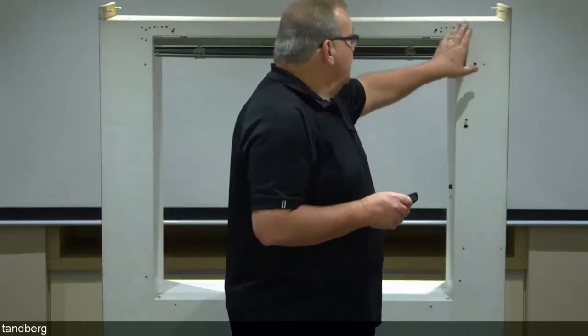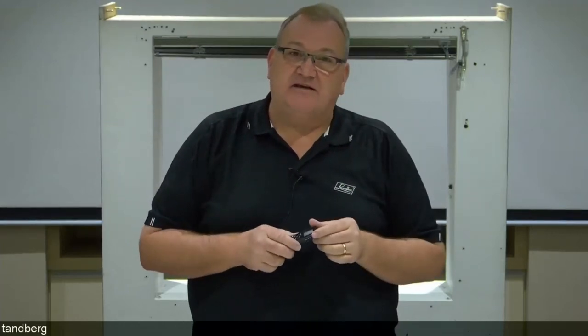I spoke about child safety when I had the slimline behind me. Obviously, it's exactly the same with any corded product. The cords have to be installed in such a way that you can't form a loop of 220mm or bigger. You can't make that loop any closer than 1600 to the floor. You've got to have that 1600 safety factor built in with cords on every installation.